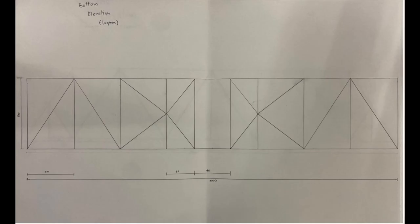The first step was to draw up the plan for the bottom plate of the bridge. The length of the bridge is 40 centimetres, as the bridge must have a clear gap of 35 centimetres. In the drawing, there is a gap in the middle for the metal frame — by doing it this way, we can ensure that the load will be spread evenly across the bridge, unlike the first trial.